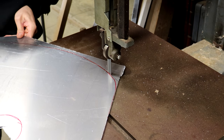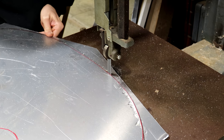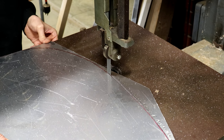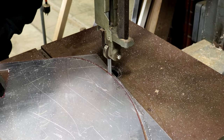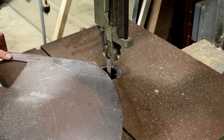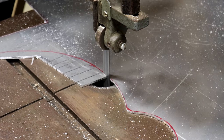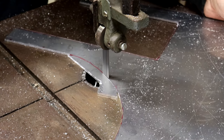And then once I finished up with the circular saw, you can see I took it over to the big bandsaw that I have, and that is much easier to follow a profile with. So you can see I cut the long sweeping curve of the top edge of the firewall there, as well as switching over to the inside to take out the material that was too close in there to get with the saw. You can see how I made those first cuts initially so that the pieces sort of break off easily, and that makes it easier to follow that tighter radius curve.